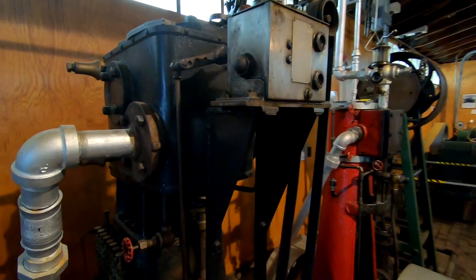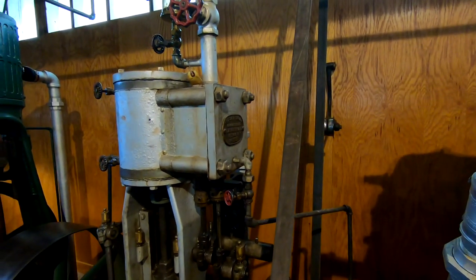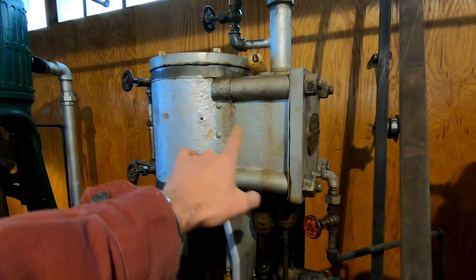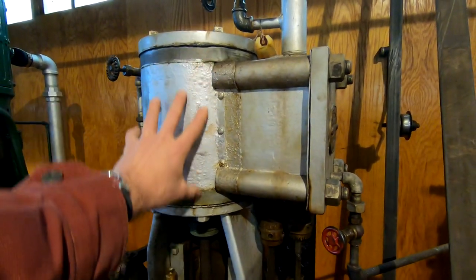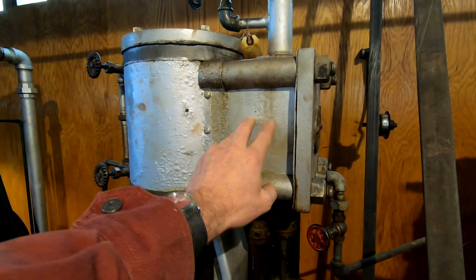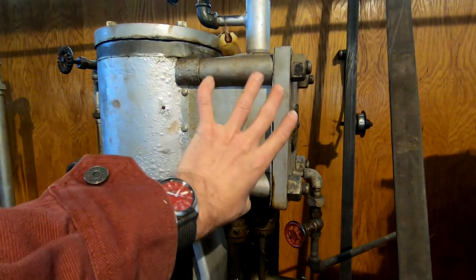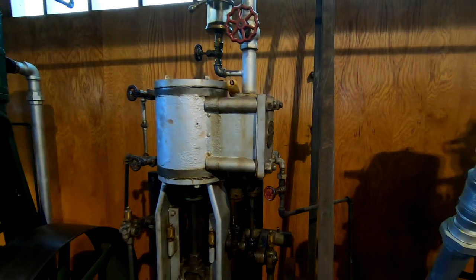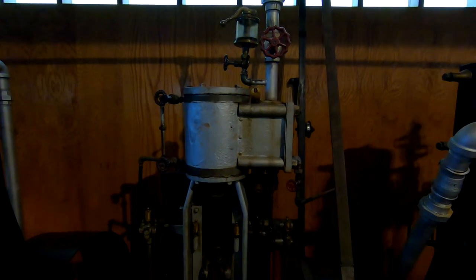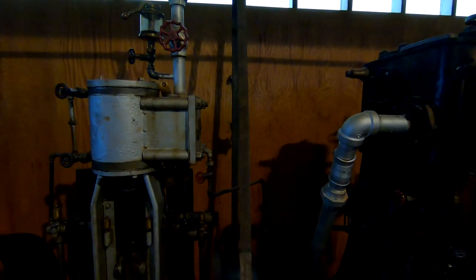It works about the same way except with a cylindrical shape. And we had looked at in a previous video the Clark and Howard safe engine here, which has the exact same type of cylinder casting assembly — the cylinder casting here, the boss in this area, and then the actual steam chest case is bolted on. You can see the parting line and the bolt. That's a slightly different valve mechanism inside, and I would encourage anyone to look at that valves video I had done previously to see that riding cutoff valve inside.